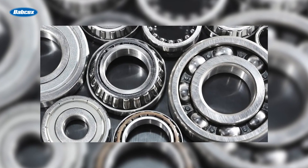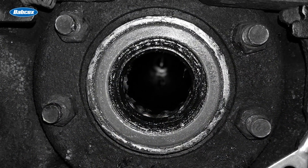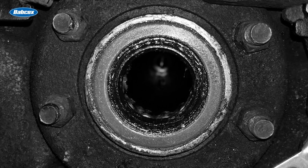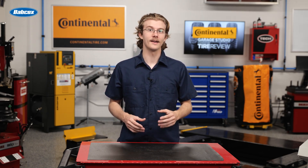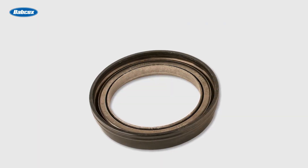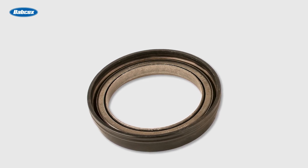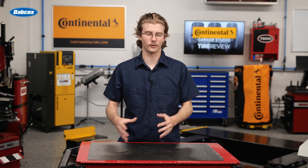Check the seal to see if it's the cause of the failure. If the seal is hard and/or worn, it's a victim of age. However, if the lip of the seal is soft and swollen, it may be a victim of non-compatible lubricants. If this is the case and the seal is relatively new, it may have been incorrectly installed. Installation failures include torn lips, dents from improper installation tools, misalignment, and a missing garter spring, which can dislodge from its groove.